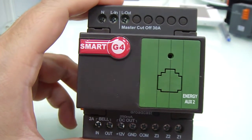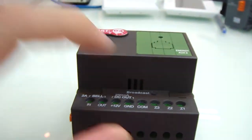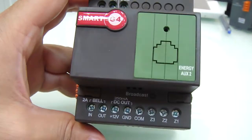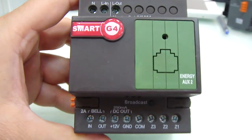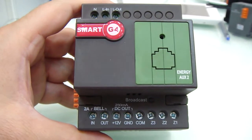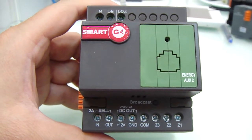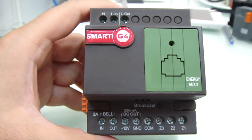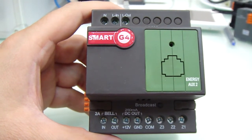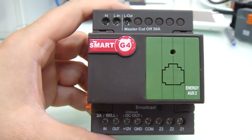The logic inside allows it to check occupancy once different motion sensors and magnetic contacts are connected. And if within a certain time limit — let's say 10 minutes, 20 minutes, or 30 minutes — no motion at all has been detected after opening and closing the hotel room door, then automatically the system is going to enter energy save mode to cut down wastage.